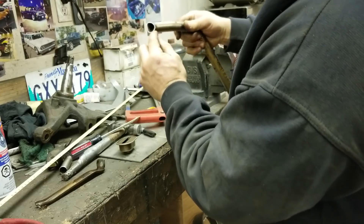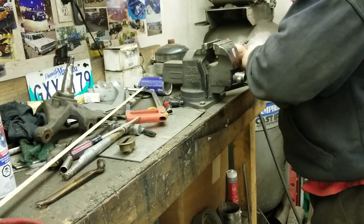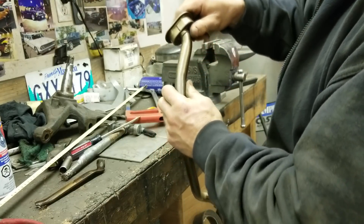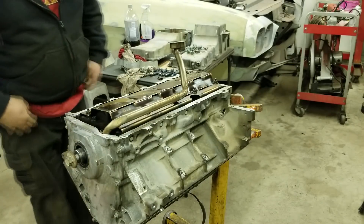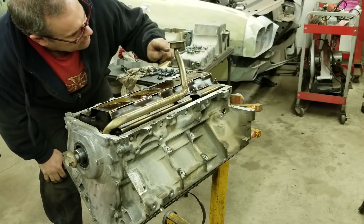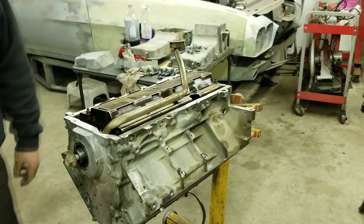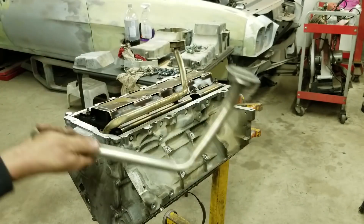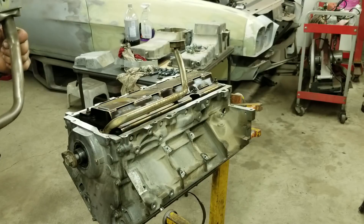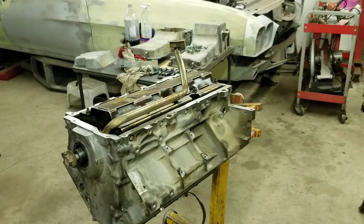As you can see it's kind of bent there, it's not very round. I'll have to try to round it out a bit. That's not too bad. I'm going to have to try it on the engine and see what I have to do. There it is positioned on there — that looks pretty good. I'll just have to smooth it out a little bit and clean it up before I weld it obviously. I actually have another one here I can compare to make sure it looks the same in terms of the angles. I think that's pretty close. I'll prep this to get it ready to weld.